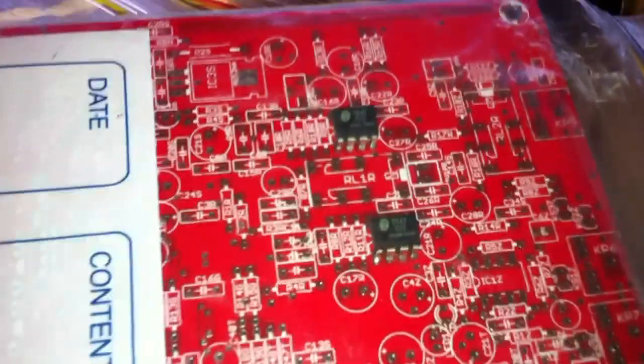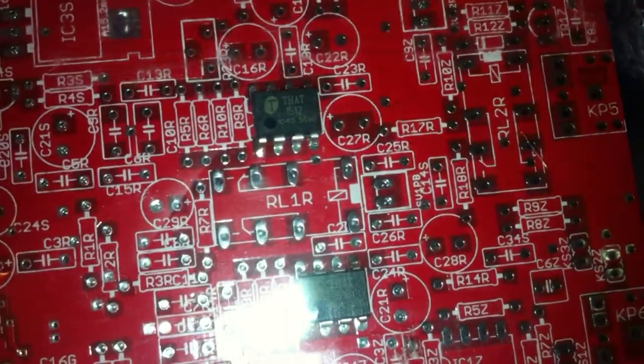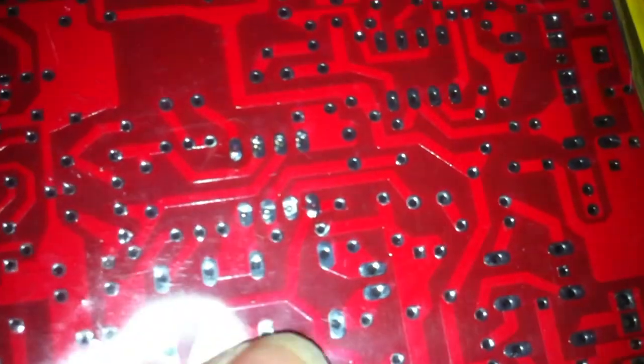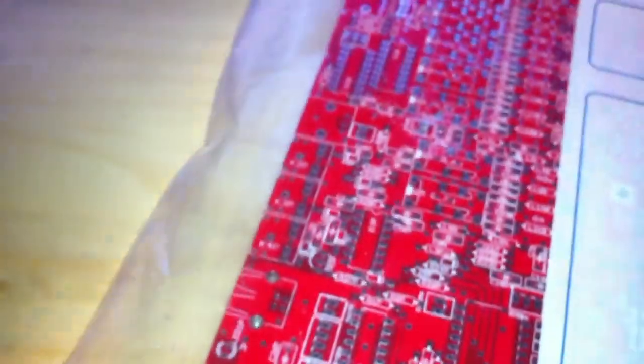And you get a circuit board. Now, this circuit board has two ICs — they're op-amps, a TL072 op-amp, two of them already tacked in. They're not fully installed though. When I started looking at the solder joints, I see that they're only tacked on the two corner leads, so those have to be soldered. That's nice of them to do that — could have done a few more parts. There are no instructions, no anything. Just parts and a board.